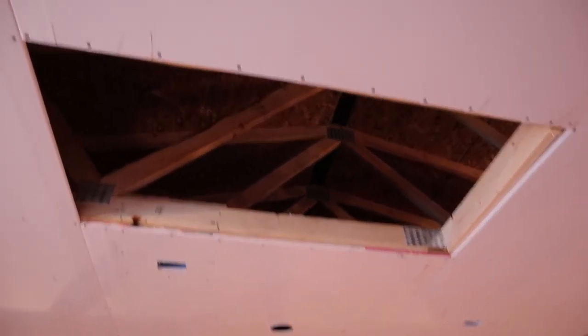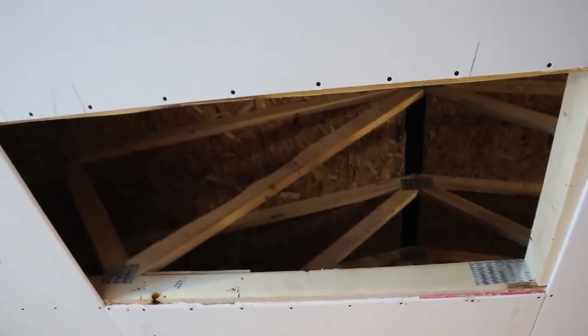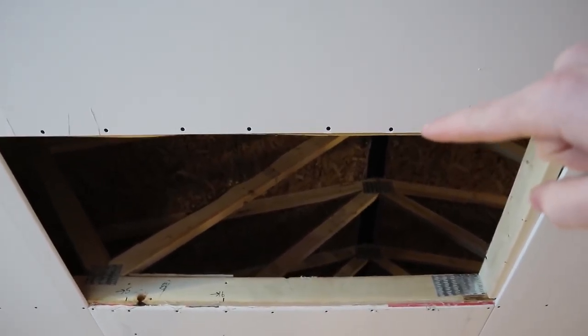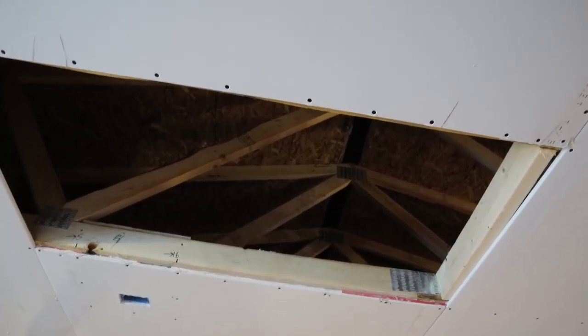Oop, I never explained what I was doing with this hole here. So this is so I can insulate the attic. Once I do everything except the area around this box, I'm gonna build a dam around this hole, 24 inch dam, and then fill up all of the space around it. And then that dam cavity, I'm gonna fill up with multiple layers of bat insulation. So if I ever really, really need to get into the attic, which I don't ever plan on, I can cut out this piece of drywall, pull down the fiberglass bats, and then access the attic as needed, which I absolutely hope I'll never have to do, because there will be hardly any access or any room up there to do anything. But there's nothing in there that's serviceable anyways, and I'm never going to have to fix leaks or anything. So, awesome.